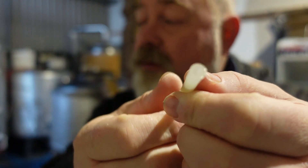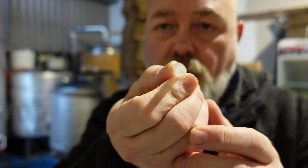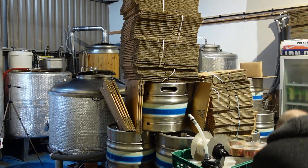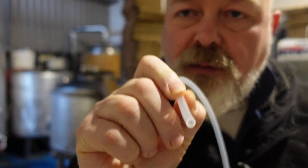So I bought some replacement hose. You can get these from Duofiller, but I thought I would just try and see what I could do with a slightly thinner wall tube. It may well be that the pinch valve doesn't pinch it tight enough to stop the flow, but we'll find out in a minute. So here's what I prepared earlier — this tube is a slightly thinner wall.